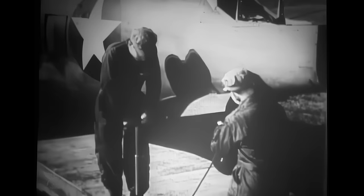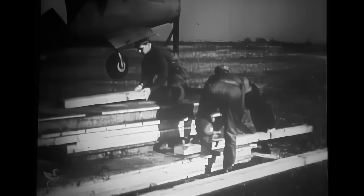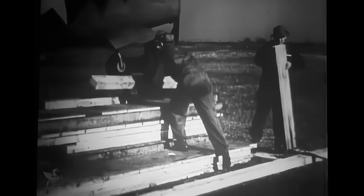In preparation for this, air is pumped into the tail wheel strut until the piston is completely extended. The man in the cockpit locks the tail wheel to prevent it from turning sideways. We must build a track for the tail wheel to run on. To do this, we make use of one of the stringer sections formerly used to carry the wing. It is sawed into 3 equal lengths and laid directly under the tail wheel in the manner shown here.